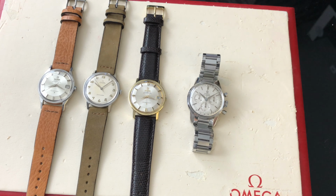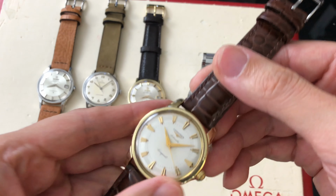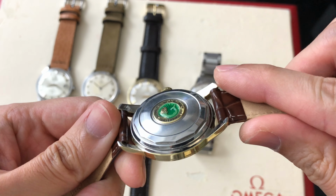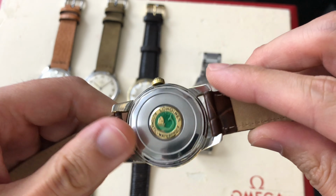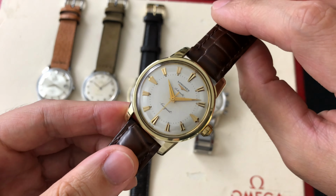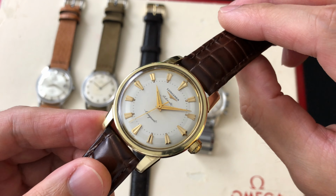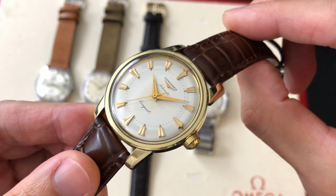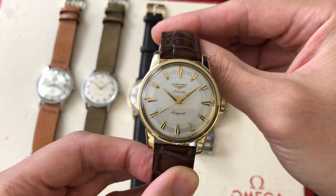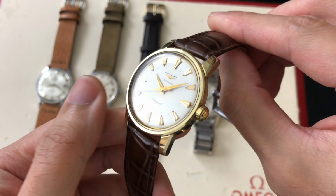Moisture can enter a watch through three main openings: the crystal, case back, or through the crown into the case tube. If it is a crystal issue, you'll probably need the help of a watchmaker to install a proper fitting one onto your watch. If it is a case back or crown issue, then you will need a new gasket replacement.